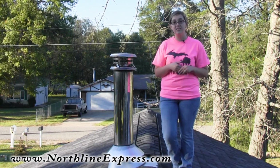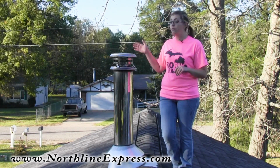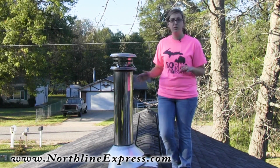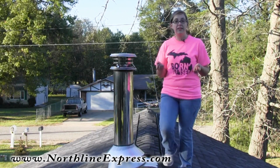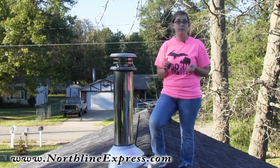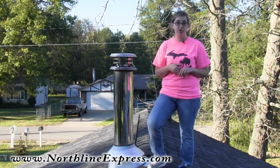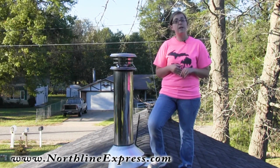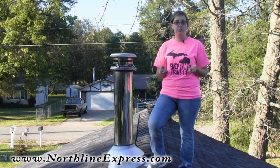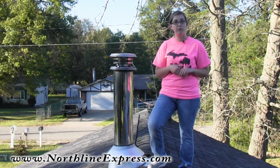That's going to leave you just deciding the lengths that you need to use. Fiberglass rods work well for top down. They also are going to work well for cleaning anything that is going to involve less than a 45 degree bend. Now if you want to clean from the bottom up, or you've got a bend in your chimney, it's going to be best to use a poly rod. They're much more flexible, they can handle those 45 degree bends, they're going to be more appropriate for that.